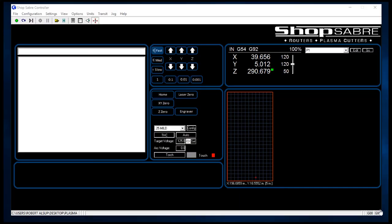Now let's actually take a look at how the operator interfaces with the machine control. You'll notice on the screen the buttons are logically organized. For instance, this group up here has to do with manually jogging the machine around. You can move in either direction — the X, Y, or Z axis. You can move incrementally, or at a slower, faster, or medium speed. The buttons on the keyboard also correspond to those, so sometimes you just use those buttons to jog.